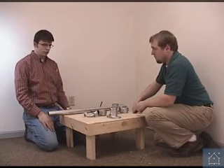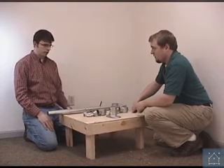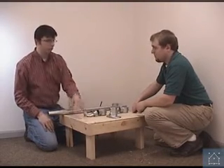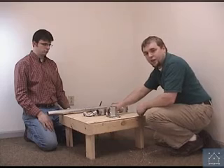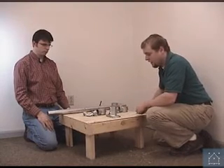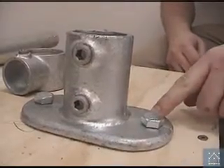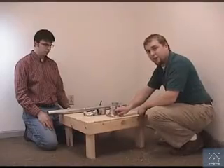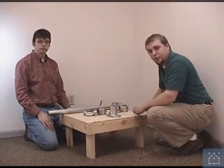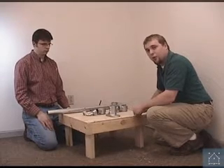We've already put our base flange down. This is a standard handrail upright. Tell us a little bit about how you attach that handrail — we've obviously attached it to wood here, but talk about how you might attach it to concrete. Typically speaking in concrete, you want to make sure you have a solid connection. You'd want to get some good anchor bolts. The size hole on the base flange is a half inch hole. You want something with a large head to bite down on the flange. Often times after drilling into the concrete, people will put some kind of adhesive inside the hole before putting in an anchor bolt, which is a good idea to ensure strong adhesion.